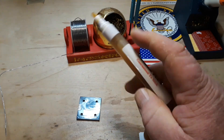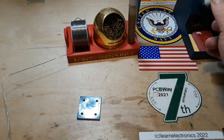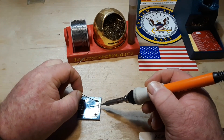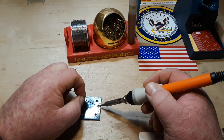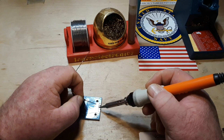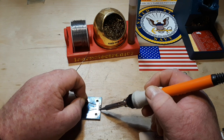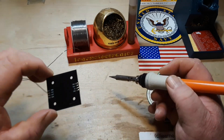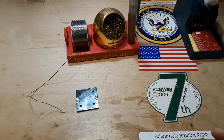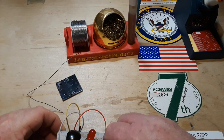So add a little Uncle Rob's Magic Solder Flux and we'll start by tinning this. Remember, solder flows where solder's been — so tin, tin, tin. I don't really have anything going out so for now I can leave the out as it is. Alright, next I'm just going to grab a PC board to sit this in and hold it.